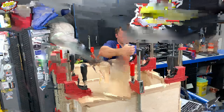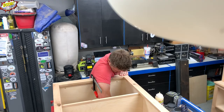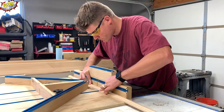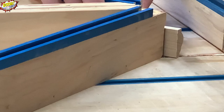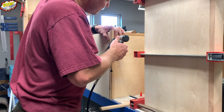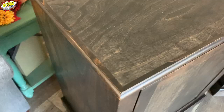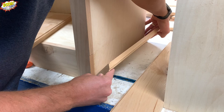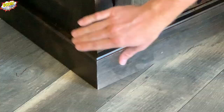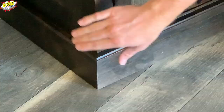There are two three-quarter inch thick pieces that are sandwiched on top of each other. This top is flush all the way around the cabinet except for the back, which is inset about half an inch. The trim you see is just base cap trim that has been mitered on two corners and is flush on the very back — this covers up any of the plywood edging from the top. The base trim is four-inch wide alder, mitered on two ends and flush on the back, with a simple cove cut on one corner just to give it a little detail.